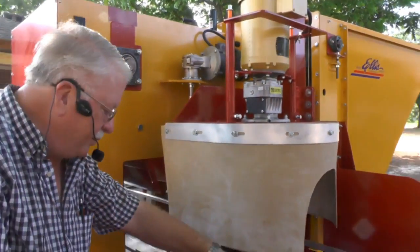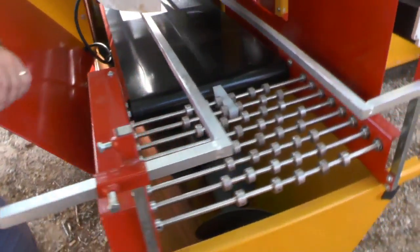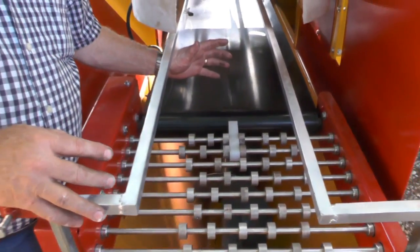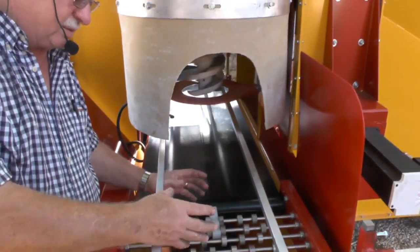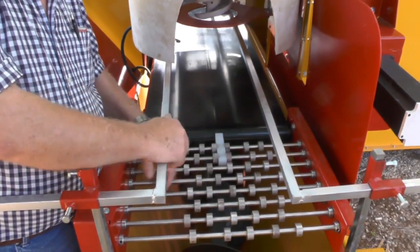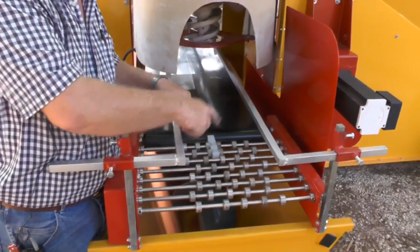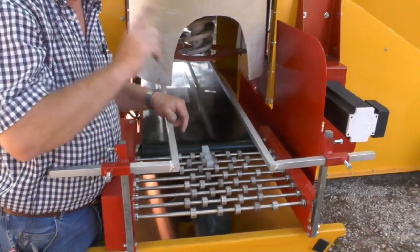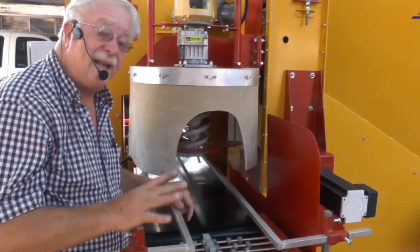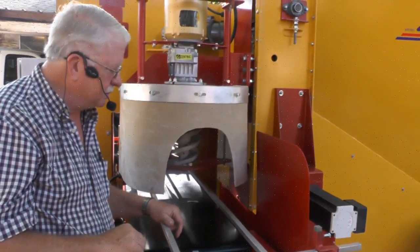And down here in the bottom, you got an auger. Now, one of the things that I want to mention right quick, when you first start potting on this thing and you're potting, and there's a pot comes through that ain't full, don't dump your pot back in here. If you got 6 or 8 or 10 pots come through there when you're setting up your machine, don't dump them back in here. Dump them back into the hopper. And remember what I said, don't overload your soil return. It'll handle a lot, but don't overload your soil return.